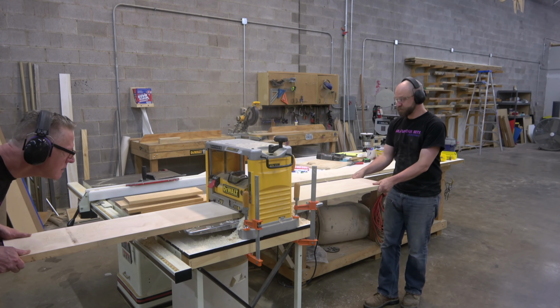Number two is, as you can see on this one, I cut my side pieces and it looks like the frame here is a lot wider than it is down here. That's because I cut them all the same and then had to remove the material to get the tab to come out of it, whereas the trough just got cut in. So I've got to take that into account on the final. We're gonna have fun with the dado blade and lots of very minute micro measuring and precision stuff to make a better one of these.